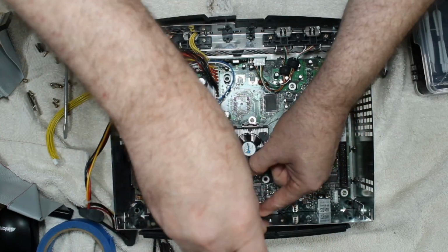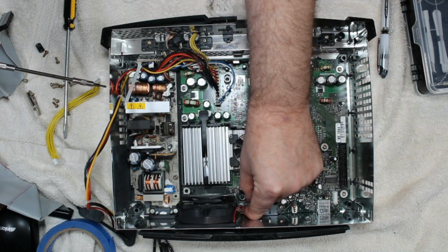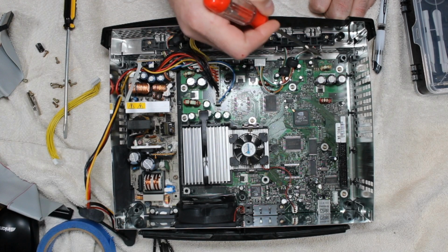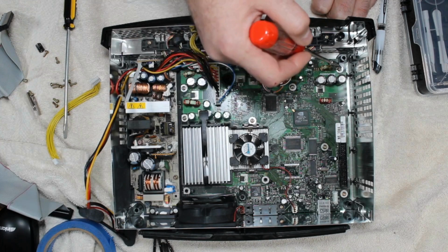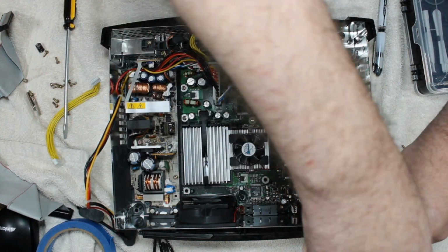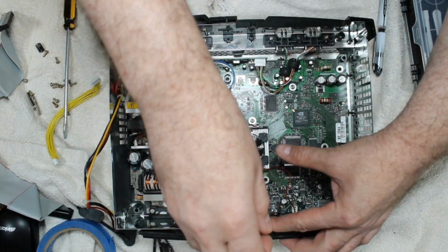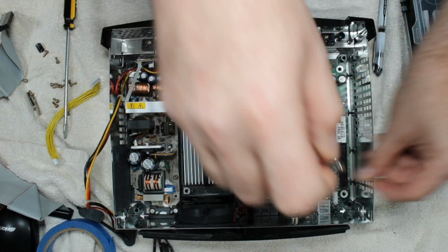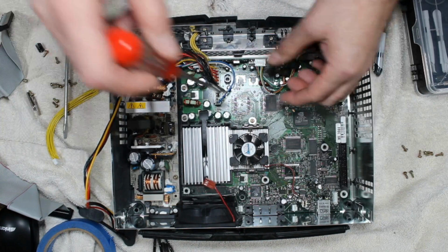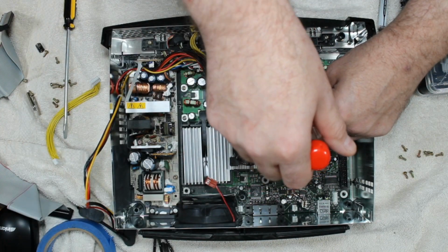Pull this board out real quick. We're going to start by cleaning off the board. Excuse me, I haven't had enough to drink today. The clock capacitor was right here. It's been removed. But you can see there's still a little bit of acid around it. So I'm going to clean that off. Make sure there's no acid on the bottom. Do a little scrubbing and cleaning on the whole board so that it will last a little bit longer. And get that acid flushed off the board so it doesn't do any more damage. Because even though the system's functioning, it's sitting on the board is causing damage, or has caused damage. I don't know yet. Should be all right. This is one I believe that was being used, so it should be just fine. But we will clean it just to make sure that it doesn't have issues down the road.